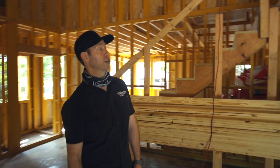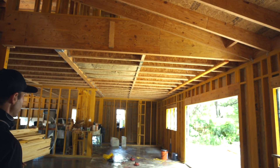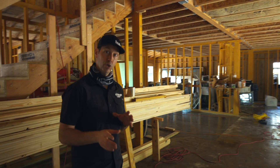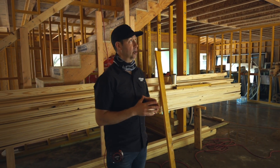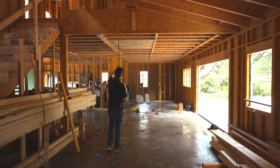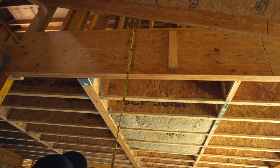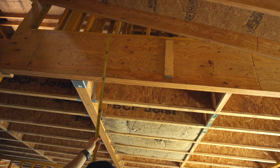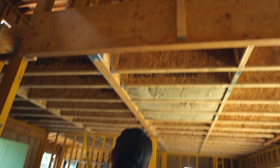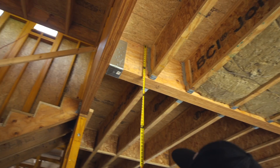Big thanks to my engineer Witt Smith — a second-generation engineer who designed all the framing for this house. I told him I wanted to use all engineered studs. You can see this is typically where you think of LVLs — look how thick that is. That's a two-foot-thick double-ply LVL, and then it's got a triple ply coming into it right here which is 16 inches thick.